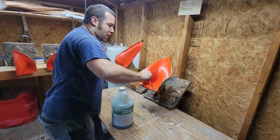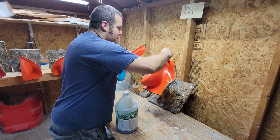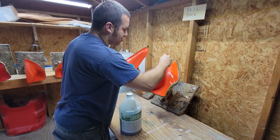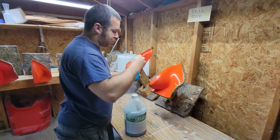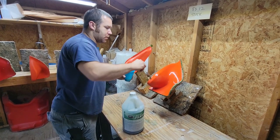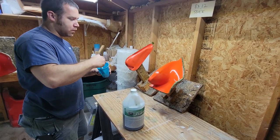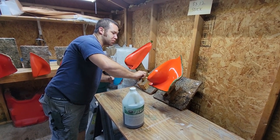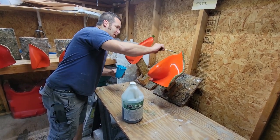The only real minus to PVA is, if there's any little bubbles or stuff like that, you'll actually see it in the final finished part. For a foothold, it really doesn't matter because you're sanding them, laying fiberglass over them, and turf, so who really cares? But on a hood or a hull, a pretty part, you really don't want that, which is why that type of stuff will do multiple coats of wax.